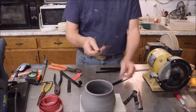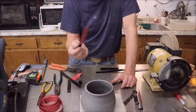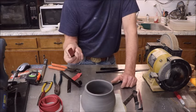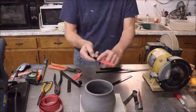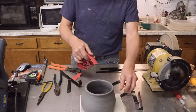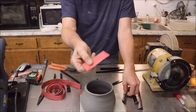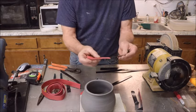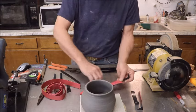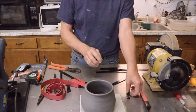Some of these have nice little red handles. The first thing you think is, well, I dipped it in that rubber paint. The paint at Harbor Freight is about 12 bucks a bottle, and I'm not a fan of it because you have to dip it multiple times. This is heat shrink - about half-inch heat shrink will actually fit on this. You cut a piece first, slide it on, center it up, then take your heat gun and heat it, and it makes it like that. Makes it more comfortable, but it's not necessary.